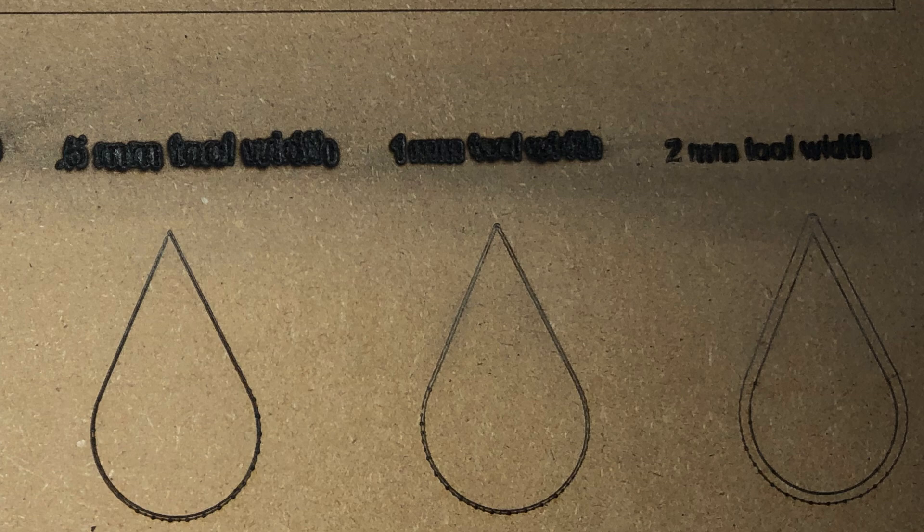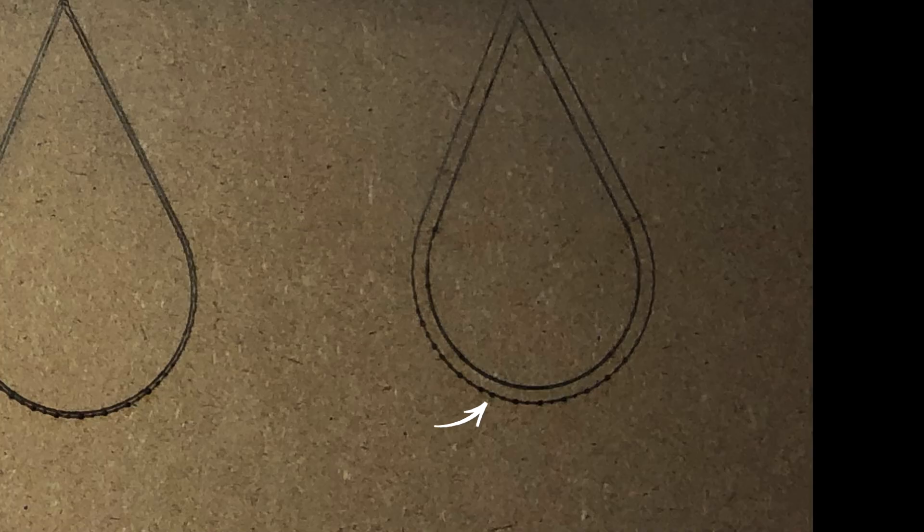On the one on the right it's very easy to see them, indicating the laser was stopping or pausing too long at those points. I went back and looked at my code — I thought I had increased the number of commands being sent to Marlin to two at a time, but I hadn't. I fat-fingered that. So I increased it to two outstanding commands, and actually tried three but it hung — apparently you can only send two outstanding commands to Marlin at a time. Once I adjusted it to two, that solved those little burn spots.